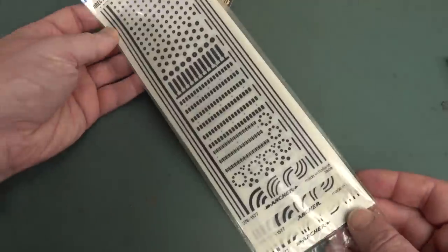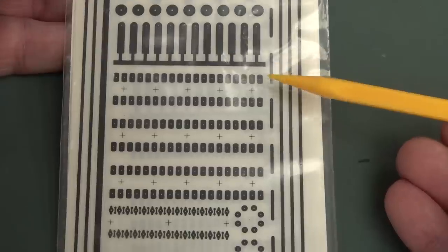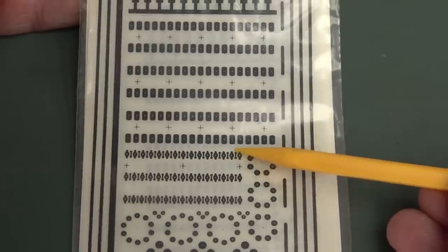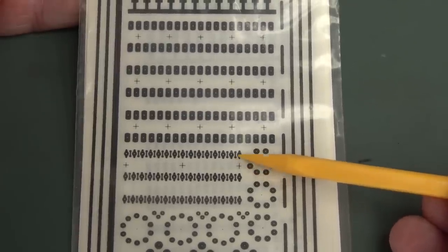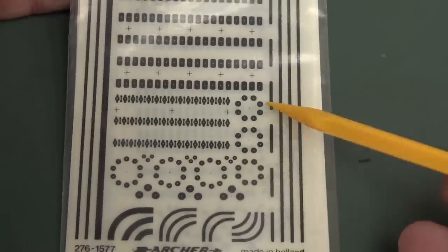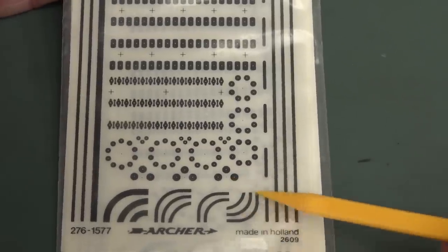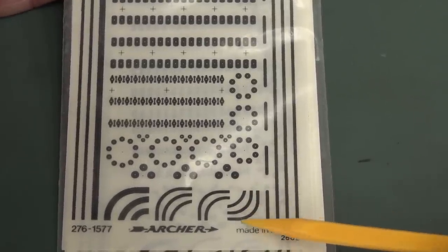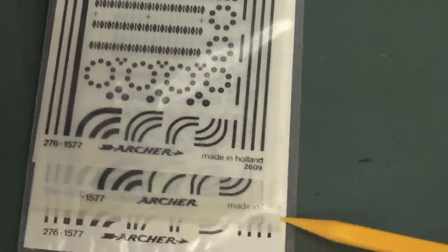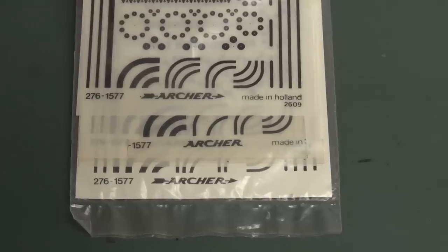None of that Radio Shack rubbish here in Australia. And you had all your different footprints. Standard 0.1 inch DIP, and you had 0.1 inch DIP with traces between so that you could get individual traces between pads. That was mind-blowing. Round metal can packages, your TO92 packages, and you even got bends, so you could bend around with your tapes. And made in Holland. All my viewers from Holland. They don't call it Holland anymore, do they?